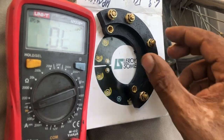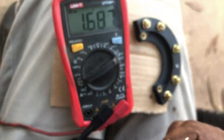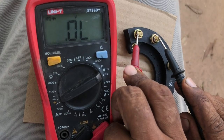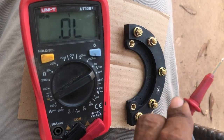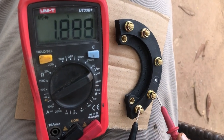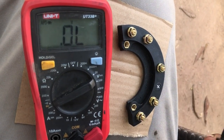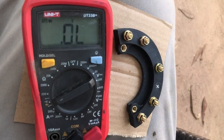The central diode is faulty while the other two have given us readings of 400 to 500. Now this is the new bridge rectifier. On connecting the positive probe at the common it hasn't shown a reading, and on reverse polarity it has shown almost 0.500 reading for the value of each diode.